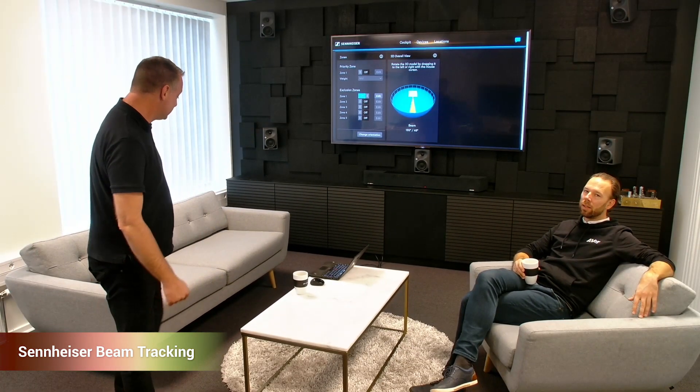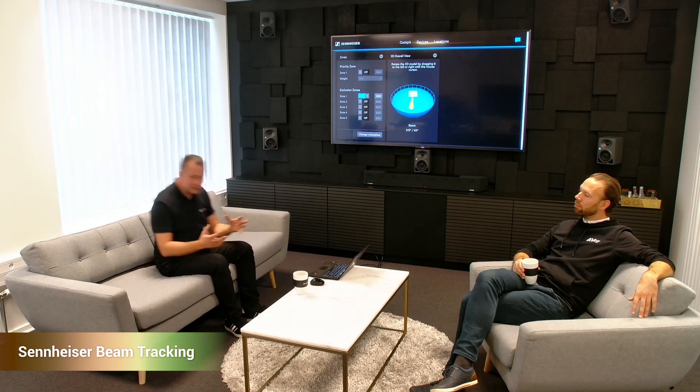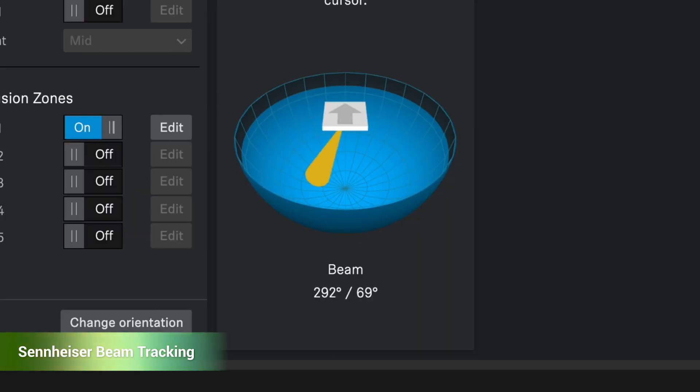I can say something now and the camera will move to me, and the yellow lighting beam on screen will point towards me. I can also try the preset out here and see if the beam is now pointing in my direction. This data we can subscribe to, or we can have the AVA software say: if you are in this area, recall this preset. We are sending out degrees both in the horizontal and vertical direction, split into eight pizza slices to make it very easy to set up. If I'm in this pizza slice, the camera recalls the preset pointing at me, and if you are in your area it recalls the preset for that zone.